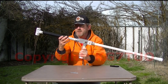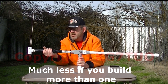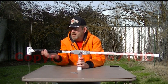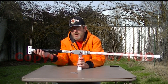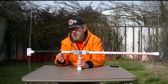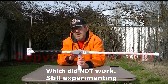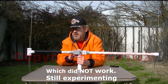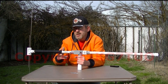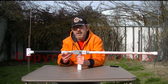And that's my antenna. It's about $40 worth of parts — this coax alone was $13 — but we're going to make the next one without that, and I'll do a video. We're going to see if this much choke is necessary. We'll start out with just a straight line, and if that's no good on the SWRs, then we will take this and put it on and shorten it up, to see how much we actually need to get a good flat SWR.